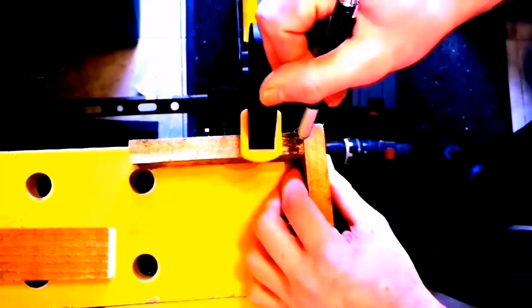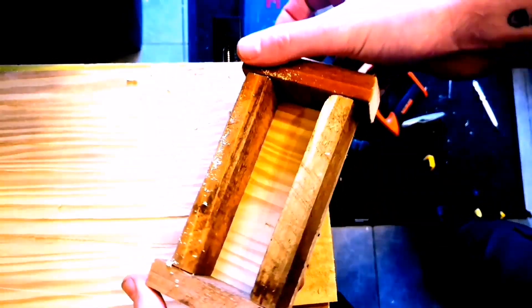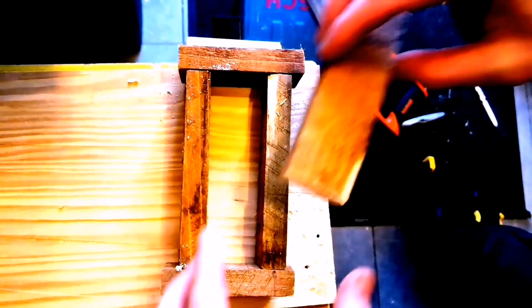Once we've got it all cut up, we need to do a little bit of woodwork to make a mold to shape this plastic. I'm going to cut three pieces around five and a half inches and two pieces around three and a half inches — literally just scraps of wood I had lying around. Not going to be pretty but it should be functional. Once smoothed off, we screw it all together into the mold shape, check the lid fits through nicely, then cut and screw a base on — just in case we need to remove it later to get the plastic out.